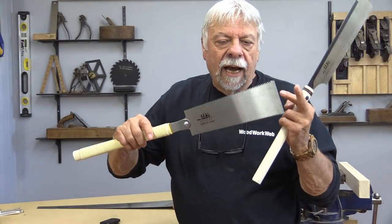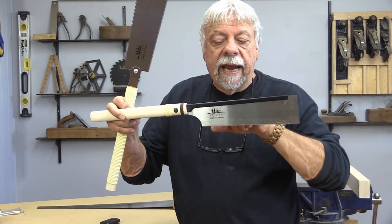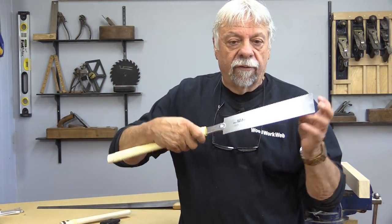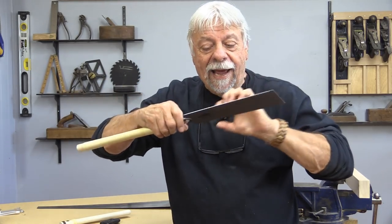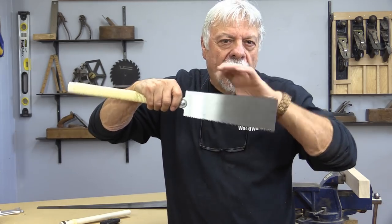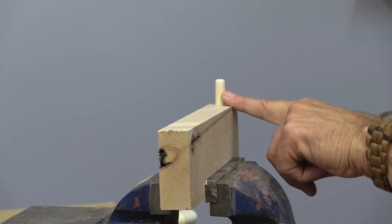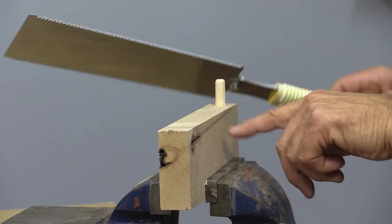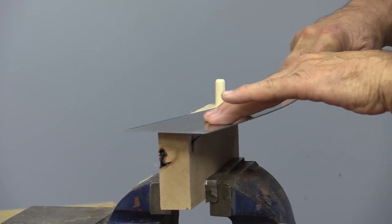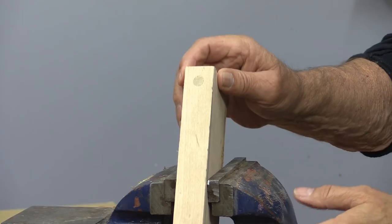I have two versions of these saws. This other one has a black supporting bar for the blade — it stops the big blade from bending. The double-sided saw has quite a bit of flex to it. You can't have a bar on that one because it's ripping; the bar would interfere with ripping through the wood. I also use a saw like this for flush cutting — for example, when I need to flush cut dowels, it sits flush on the wood and I can just pull it for a nice trim flush cut.